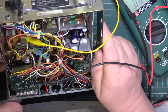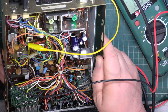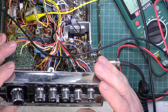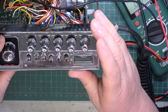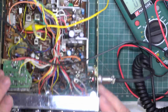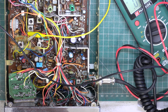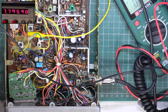Has it got the right chip in it? LC7137, it has. Oh, there's an interesting one. No wonder he's struggling. So we'll pop the RF gain up. We'll make sure we've got that. Got no meter light on this. Delta tune to center. Put the signal generator on, and we'll put in, let's put picture in picture on, we'll put 27795 onto the signal generator.